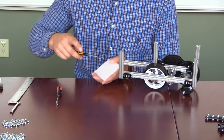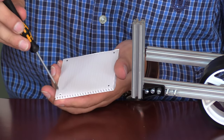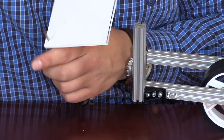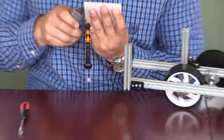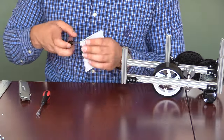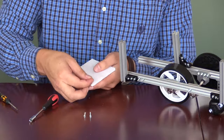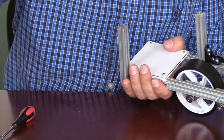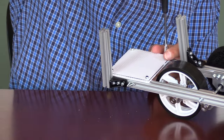We will take a sharpie and mark on it four points near each of the four corners where we can poke a hole so that we can attach this piece of plastic to the extrusion with screws. To set up the holes, we will use a small screwdriver — put the tip at the point marked with a sharpie and slowly rotate the screwdriver until we have managed to poke a hole all the way through the plastic. Once we do this, we will take our box cutter and cut around the head of the screwdriver to remove any residual plastic. We can repeat this process for each of the four screw holes. Then we can take four bolts, slide them into the holes, take the entire assembly and slide it onto the piece of extrusion making sure we don't touch the wheel, and attach the nuts to tighten everything down.